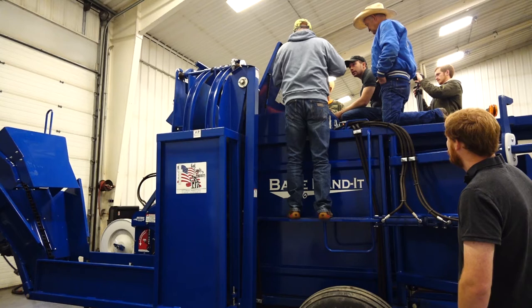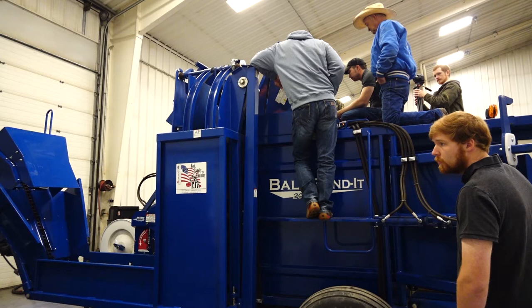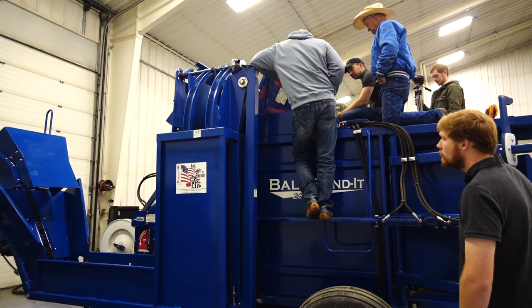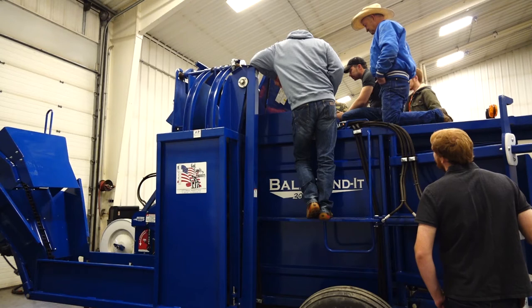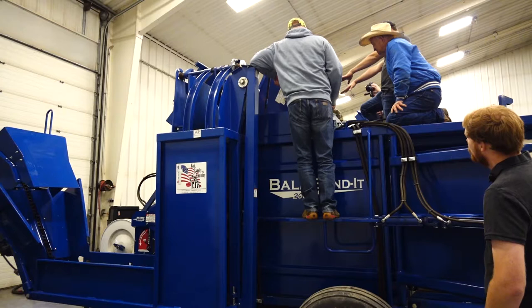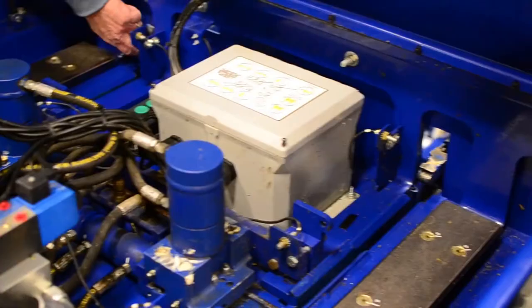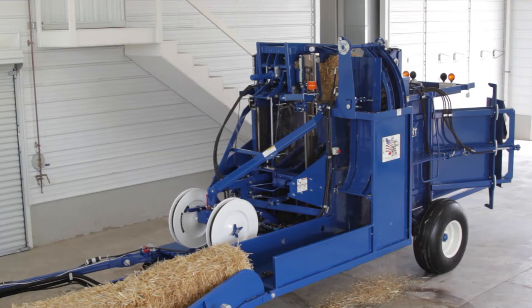The more information we can give you — that's why we switched over to the iPad. It just gives you more information and more flexibility. While we're up here, let me step you through the whole 21-bale process. The bale comes in and sets on the strap guard arm. The strap arms are up in the box — you can see the tip of the strap guard arms right here. These fingers flex up and down.